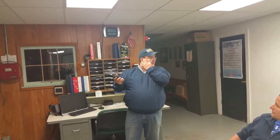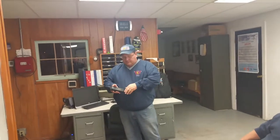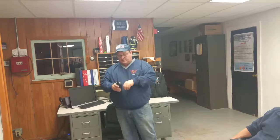So if you're in Harrison Township and you need a Johnson County dispatch and you're on your Ops 1 channel, when you just flip that button to B, you're now on Johnson County's Ops 1 channel, and you can talk to their dispatcher and order up equipment from that department and not have to go through your dispatch. It makes life a lot quicker and easier using the ABC button. The other way to change the radio is to go down to the keypad on the front and go through that. We'll go through that next when we turn it on.